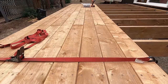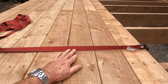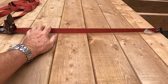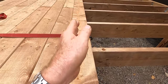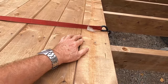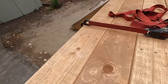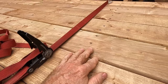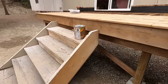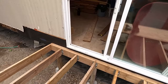I just showed you in time lapse how I laid the last four rows. You may have noticed me using a strap — these boards are warped and twisted and sometimes you have to pull on them to get them tight. As a one-man operation, I just use a tie-down ratchet strap: hook it over the board on one side, hook it back over here, ratchet it tight to pull your board in to where you want it, then go ahead and screw it.